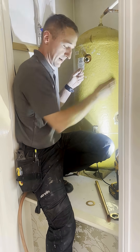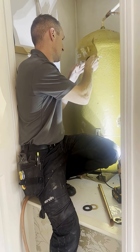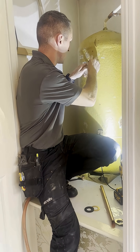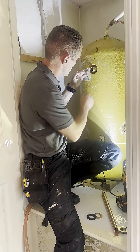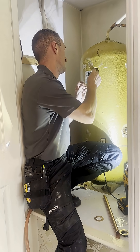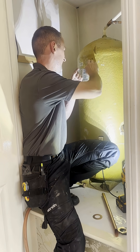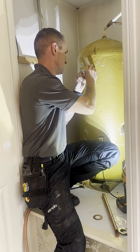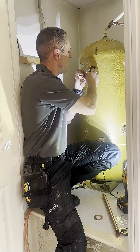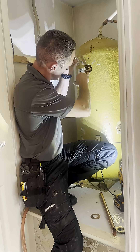Just leave that there hanging — let's leave that on the side for now. We're then going to spin this, let that go in, and just push this washer. So that's there — we can see that copper washer is on there. We're now going to feed one of the rubber washers — doesn't matter which one. We're going to push that in, and it's flexible so we can push that, let it fall in. We've got it on the coat hanger, and then we're going to push it over and try and centre it, so we've got an even gap around.